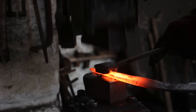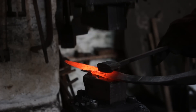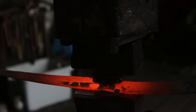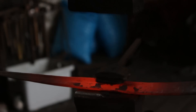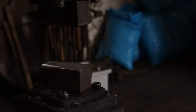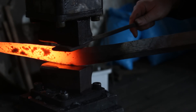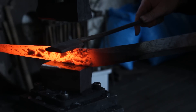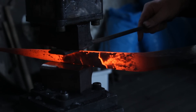I'm doing this at not too high a heat — I don't want to move too much metal, I just want to ensure crispness in these fullers. For those doing this by hand I would just say grind these fullers in if you don't have the benefit of a power hammer. Then I'll come in with the flatter again to carry on defining the edges of the blade, squaring them up and making sure I have a nice chunk of material to grind into when I get to the grinding stage.